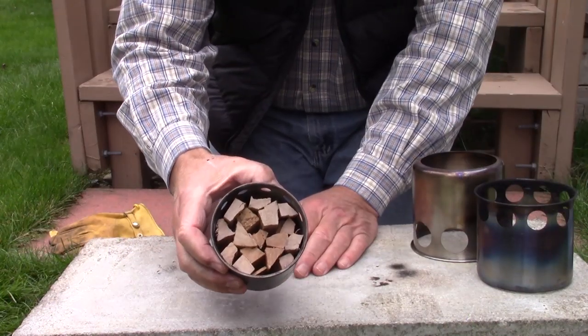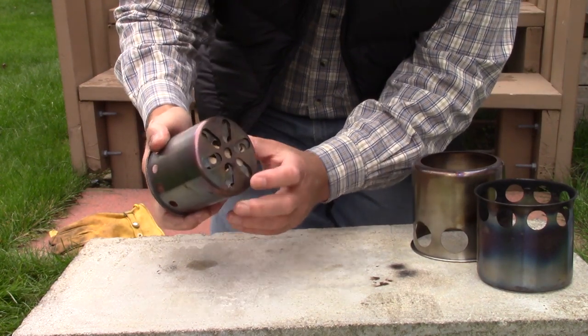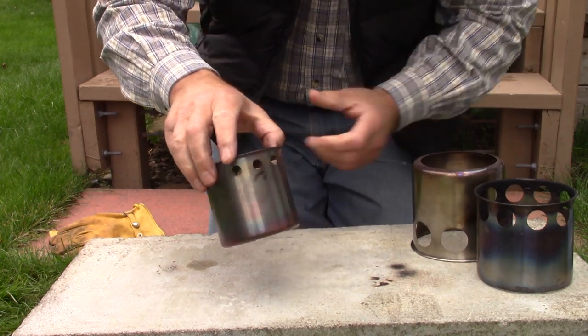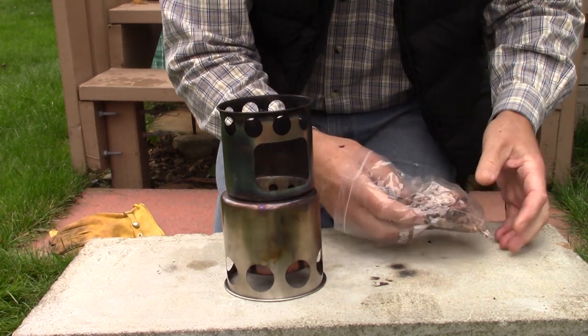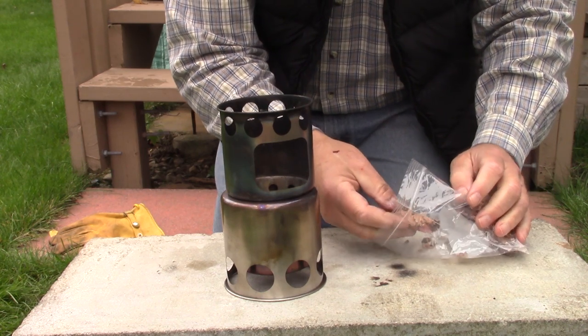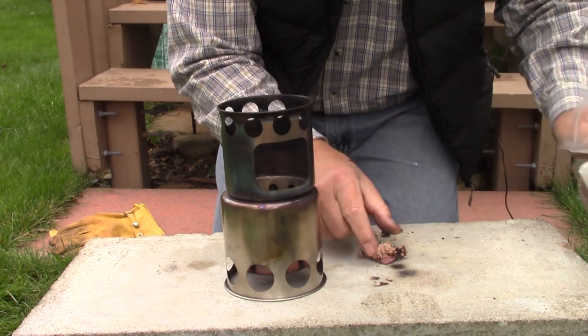So what I'm going to do is pre-load the stove — I'll show you that, then I will light it and we'll give it a few minutes for the wood to engage and see if we can actually get gasification. I have pre-loaded the burn chamber with enough wood for a good burn. This is again split dry hardwood and I have the metal plate inside. You can see I haven't occluded all the holes but some of them are still there. I'll be dropping that down through the pot stand into the base. Using a little bit different fire starter today — just a combination of wood chips, candle wax, and pine resin pulled off some of the trees. It should be enough to get the fire going without any additional kindling on top, though it may take a little longer.